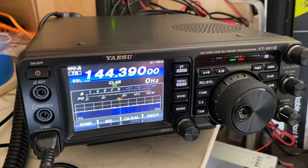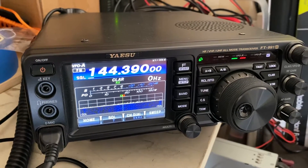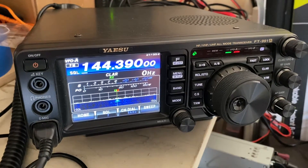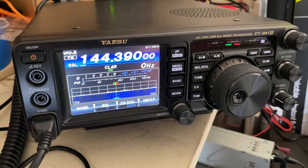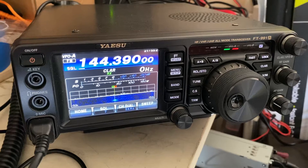So I was sitting here playing with the Raspberry Pi, the DigiPi, and put it on APRS digipeater. The direwolf log says changed it to 38400 baud, and that seemed to make it work. We get something that can be digi-repeated — you'll see the red light come up for transmit.